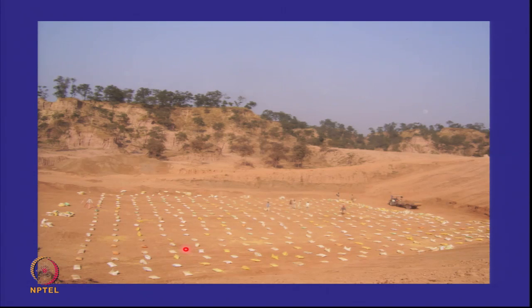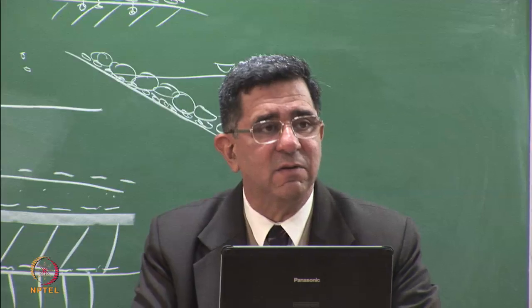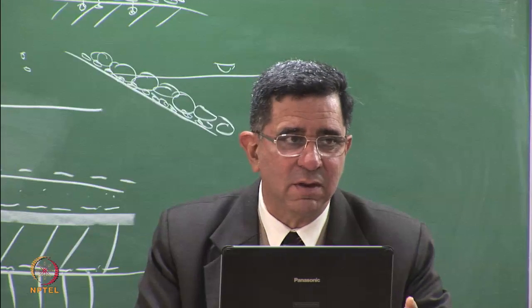And here, I talk to you that if you don't have clay, then you have to mix with bentonite so that you can reduce the permeability. So here the soil did not have 10 to the power of minus 7 centimeters per second, and bentonite is available to us like cement, because a lot of people make drilling fluid. Metro is using a lot of drilling fluid for tunneling, for making boreholes, for piling. So commercial bentonite is available. You can go to a shop and say, mujhe ek bag bentonite de do. It will cost you similar to cement, maybe half the cost or something.